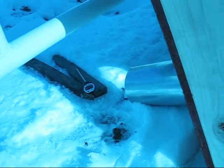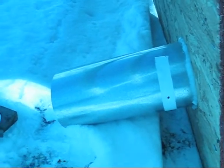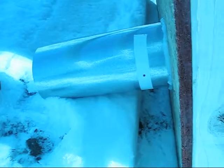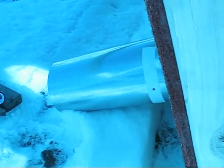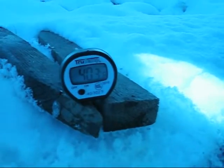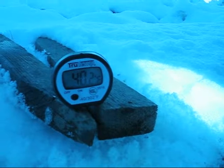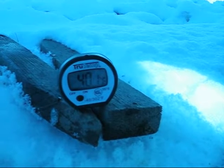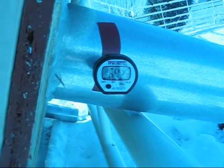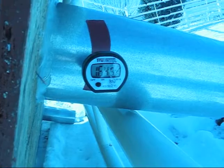It's been 30 minutes. I drilled a bigger hole to make sure the thermometer wasn't touching the pipe, so I get a true representation of the outside temperature. It's warming up out here — I do have it in the shade, but it looks like it's about 40.2 degrees, 40.1. And on the hot side, after 30 minutes: 164.2 and rising. That is awesome.